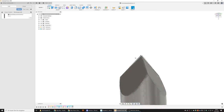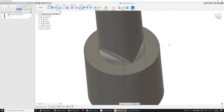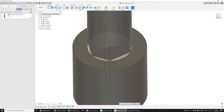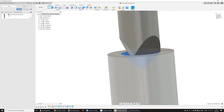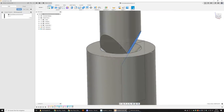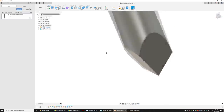This is the actual tool used for spot drilling — a pyramid-shaped piece of carbide. This one is 3mm in diameter and has three flats ground onto it, evenly spaced at 120 degrees apart, creating three cutting edges. The cutting edges have a highly negative cutting edge angle — it's more of a scraping action than a positive cutting action, but it works surprisingly well in almost all materials I've used. Here is a piece with a matching spot drill: the edges are contacting the taper of the bore. The flats we grind here are not at 45 degrees — it's a compound angle problem. In CAD, for a 90-degree spot drill geometry, these flats work out to 36.4 degrees. That's what we need to grind three times, evenly spaced, to get a tool that looks like this.